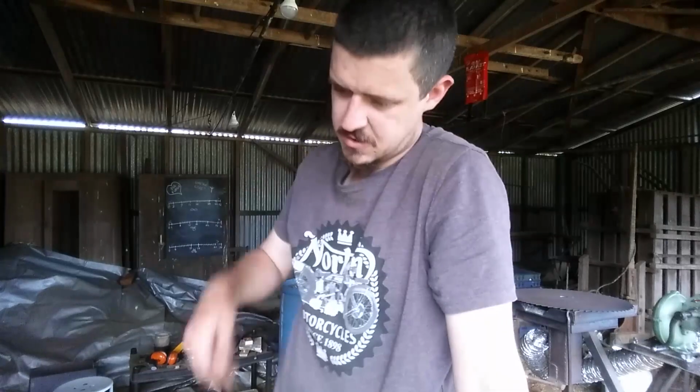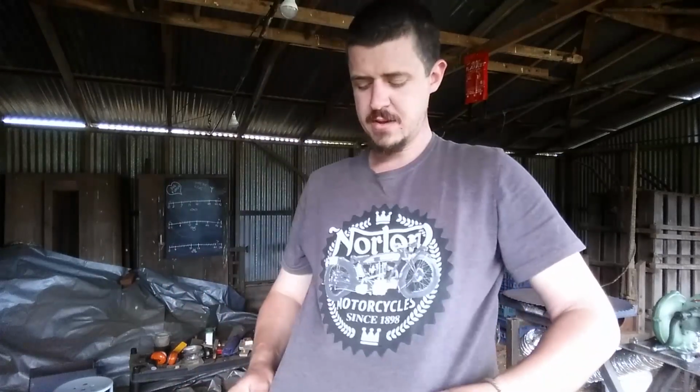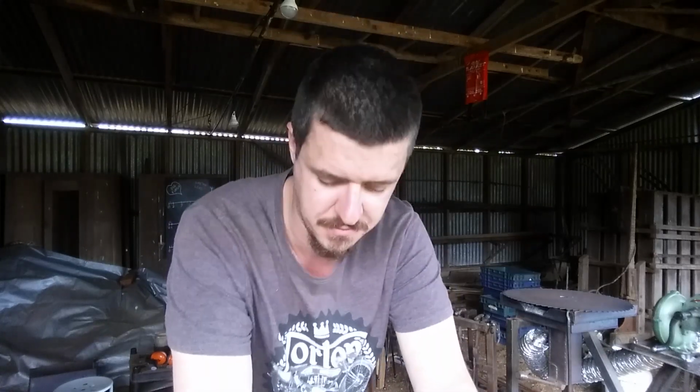It's very exciting, especially for people doing their first Damascus weld, or beginners that are trying it out. It's very easy to get overexcited about doing it and not pay as much attention as you could to your safety. A lot of people have open quench tanks, extra solvent bottles, WD-40, or all sorts of things that are flammable around their workshop. Even clothing: copping a full load of molten metal on a cotton t-shirt, you can catch on fire yourself. I wear a lot of flannelette. It's a danger that you have to be aware of, and that's why blacksmith aprons are quite good. But potentially it's something you hadn't thought of, or maybe hadn't seen yourself because you may not use slow motion cameras.